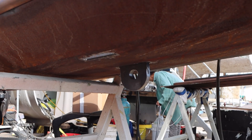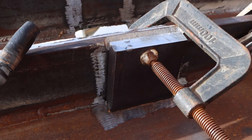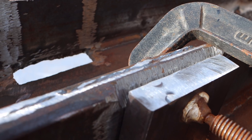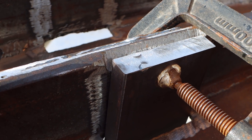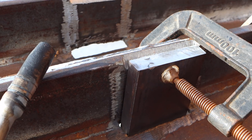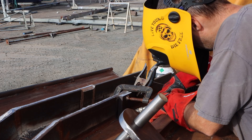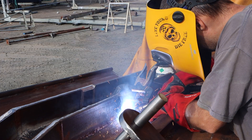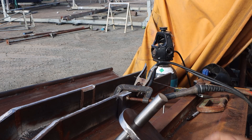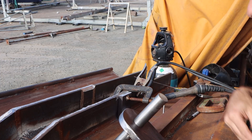Surprise time — we've got our first hinge coming through. She's clamped up, measured up, and where it needs to sit. You can see that bevel — it basically sits there and you've got quite a gap that needs to be filled up with weld. The plan is to cut the equivalent side off at a 45 and fill that whole thing up with weld. For now we're just going to tack it in, get it all lined up straight and lovely, and that'll allow us to measure the one that needs to sit over there. I'm just tacking it down the bottom because I don't quite trust that it's straight, so I want to be able to adjust it — tacking at the bottom lets me give it a slight tweak with the hammer if I need to.